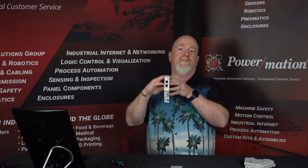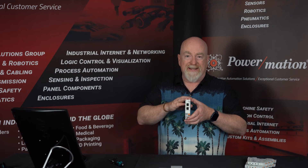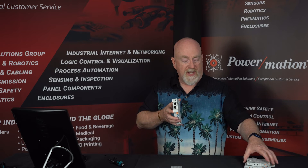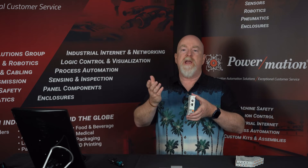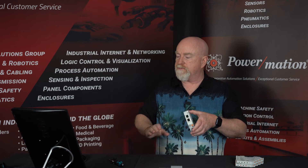The data you can write to using the communication module includes: channel status — I can physically turn a channel on or off across the network; I can set the amperage value remotely instead of pressing buttons or turning knobs on the unit; I can reset a fault remotely once I've verified the trip condition is clear; and I can lock the amperage values down, which disables the rotary switches or push button switches from changing the amperage settings. This is very handy once you have values set and locked — they won't get changed without permission.